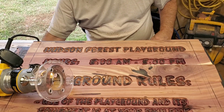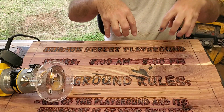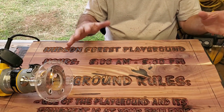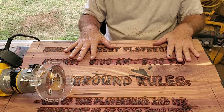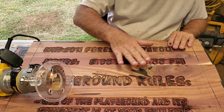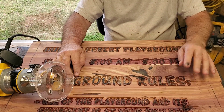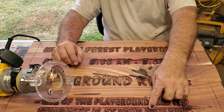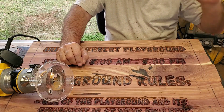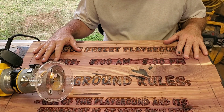What I just got through carving — and that's what all this is around here — is called a cloud effect. This is going to get painted black in the background, and then the tops of the letters are going to be painted white, so it's going to be stark and contrasting — very legible for residents to view when they come to the park. I'm going to finish that up, clean up some down here as well, flip the board around, do my last cleanup around the smaller letters, and then I should be able to get the spraying done and get started on this background.